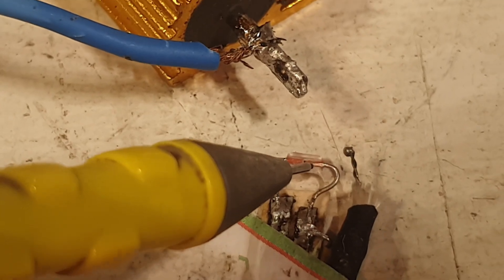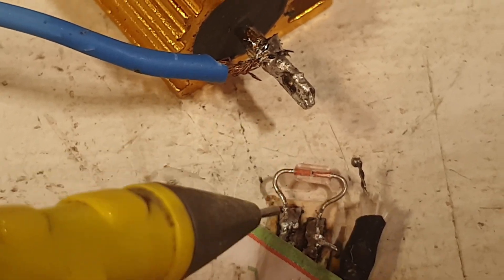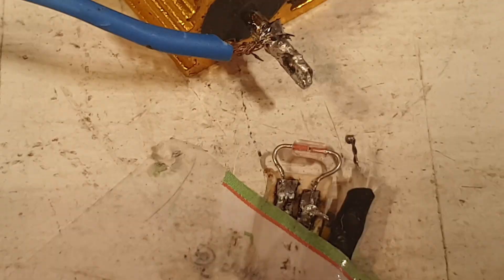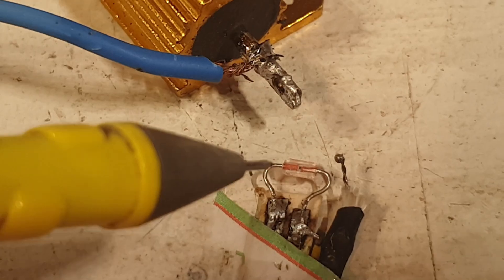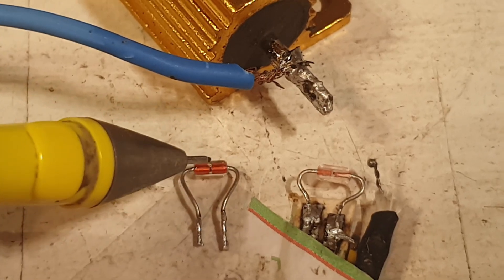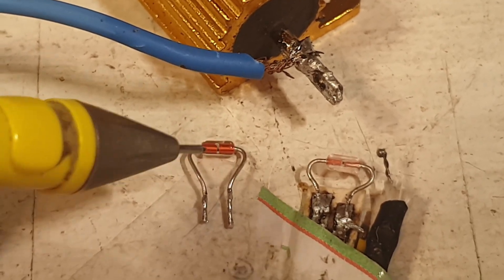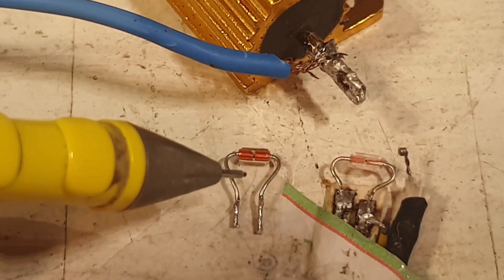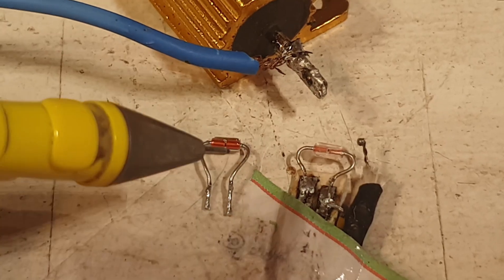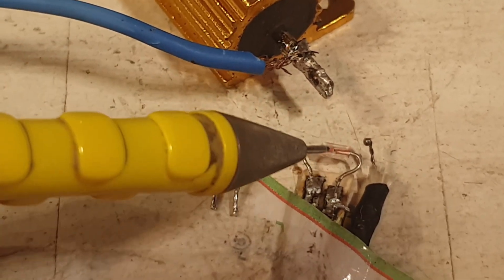By shaving it, I got very close to the copper cylinder inside — probably where the actual sensor element sits, held by copper legs. The legs are likely copper, then treated with nickel, depending on the manufacturer. I did this because I wanted to get closer to the heating element. One theory was that the glass insulator was causing delays and shifting in readings. It helped a little, but not enough to give a satisfying result.